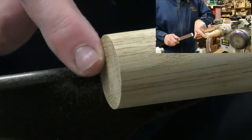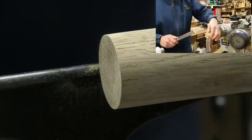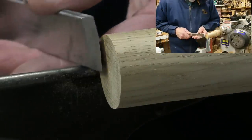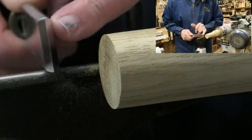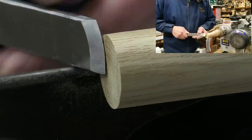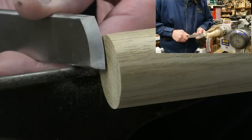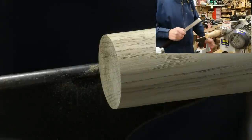Now I've got to show you the peeling cut. The peeling cut is basically a cut across the end grain of the blank to make a nice smooth flat surface. You can do it with the regular skew, but I feel much happier with the radius skew for most of my skew work. We're going to use the toe of the chisel — the idea is to get the nearer bevel at 90 degrees to the blank. The gap between the face of the blank and the bevel should be as small as possible, but be aware — if you go too far you will get a catch, so keep it a bit out until you've done some practicing.